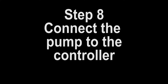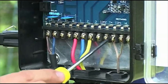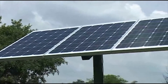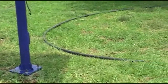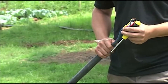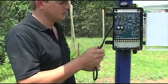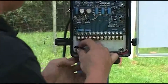Step 8: Connect the pump to the controller. First connect the solar panels to the controller, then the pump to the controller, and thereafter the sensors. Make sure the control box is in the off position — you can find the switch at the bottom left between the battery and solar port on the circuit board. A: secure the control box underneath the solar panels or in a well-ventilated box. B: make sure the cable running from the pump to the box is inside a pipe or trunking. For lightning protection, put the cable in a galvanized pipe. C: open the lid. D: connect the solar panel module. Make sure you do not short circuit the two wires from the solar panel modules as it will damage the panels and cables. Tape enough electrical tape over the ends before pushing the cable through the controller port hole at the bottom of the box.